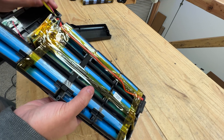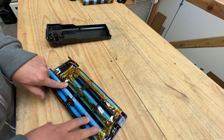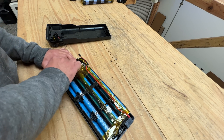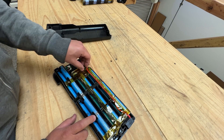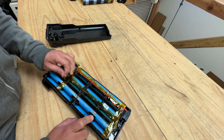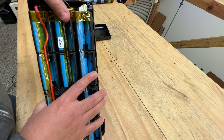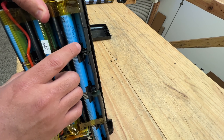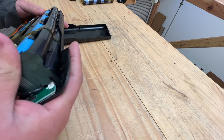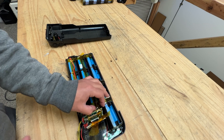Here's the BMS. The BMS has the little indicator here. I checked the voltages of all the cells on this one and they are okay — they're exactly at nominal 3.7 volts — so that means the BMS is off. The BMS is bad because it doesn't let you turn on; the little indicator doesn't work. At nominal voltage it should be somewhere around 50% state of charge. Look at these — these are also INR 29E cells. This is a different style of 29E, but it's a 10S configuration, so 36 volt.